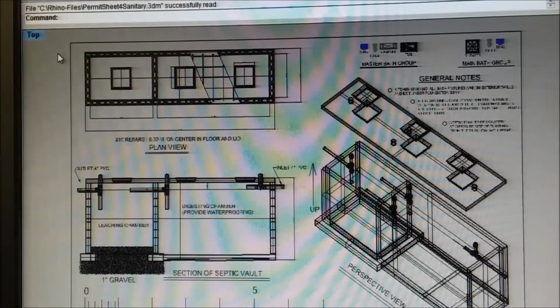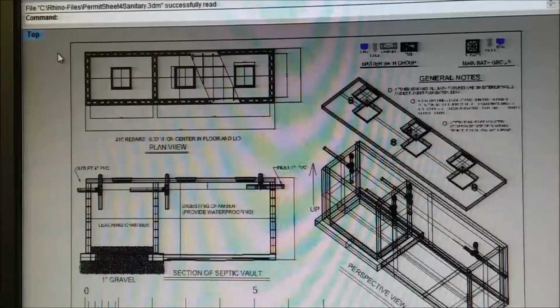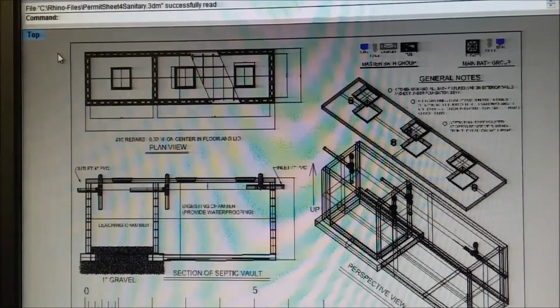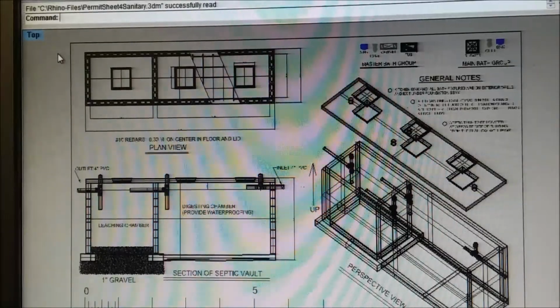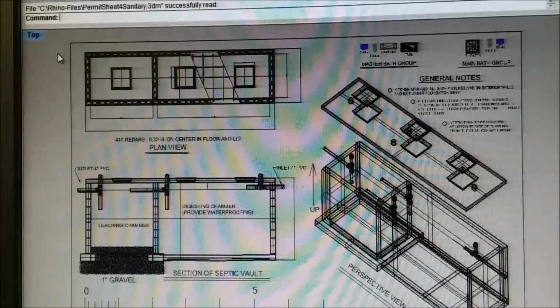The fire department changed ours. He changed the floor plan. That's the one you don't want them to change. He required 2 means of egress out of every room. That was not hard to do. It was just a matter of putting doors in walls, because it didn't move any walls.